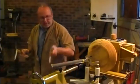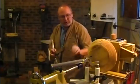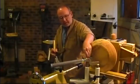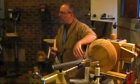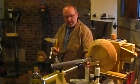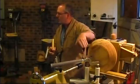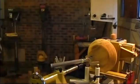The other part of the system is the support piece here. As you're cutting, initially I'll start off and have this adjusted up to where it's close to the piece. As I start progressing the cutter inside the wood, I'll stop and insert this in there so it provides continuous support as I get further and further inside the piece. That's one of the aspects of this system that provides a lot of stability and confidence, is that you don't get into vibration or other types of instability that you might with some of the handheld types. Pass it around. You all can see that.